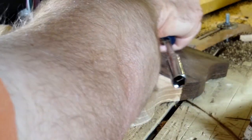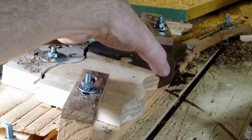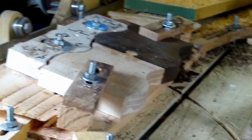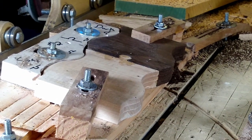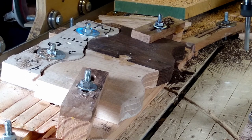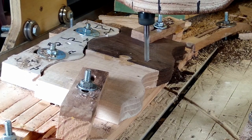Now back to some live video at the CNC machine. Here I'm actually mounting a piece into the jig at an 11 and a quarter degree angle and clamping it in. It fits very well in that clamp, so I know every time it will repeat. Very repeatable — that's so important. If you don't have a consistent piece, it will never match up in the end. It takes a minute or two to clamp it in, and now we'll run the CNC. I'll let it go at regular speed for the first pass, then speed it up.